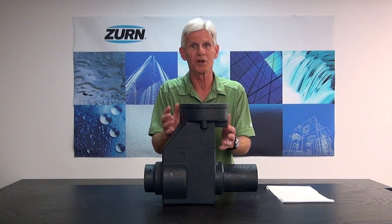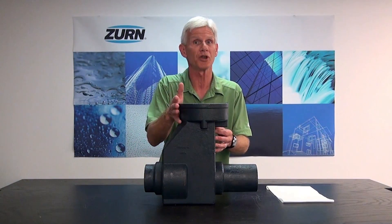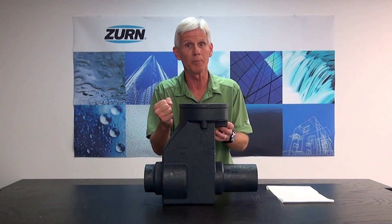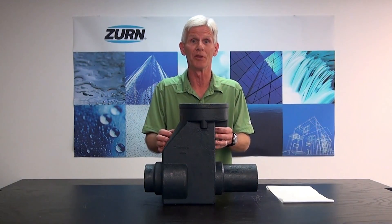but there's an added layer of security in that this valve also serves as a shutoff valve. So you get dual protection: the check valve preventing the effluent from returning into the building, plus the shutoff valve to give you positive insurance that we're not going to have that effluent backing up into the building.